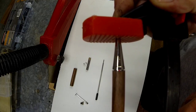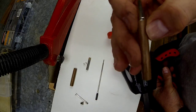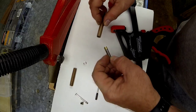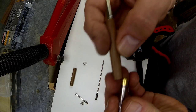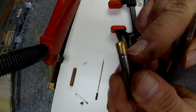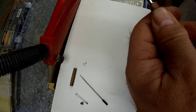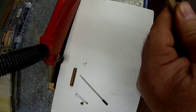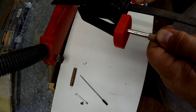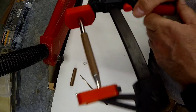The first thing I'm trying is pushing the end piece into here — when you squeeze it up you've got to make sure it stays straight, otherwise it'll ruin your pen. Just press it up. Got to be ready to stop as soon as it gets tight — so that's pressed in. Next, I need to press that piece into this end and stop just shy of the indent. That crack you heard wasn't the pen — that was the clamp breaking.